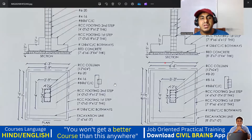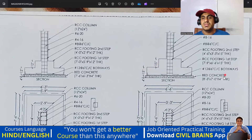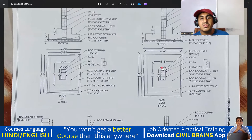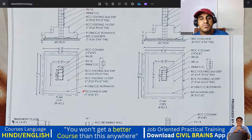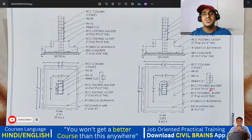Looking at the depth of the footing — previously in C1F1 it was 12 inches and 12 inches for the two steps. But here you see it is 15 inches and 15 inches. Also see the size of the footing: C1F1 first step was 7 feet by 5 feet 9 inches, but C2F2 is 7 feet 9 inches by 6 feet 6 inches — obviously bigger. The second step was 4 feet by 2 feet 9 inches for C1F1; this is 4 feet 6 inches by 3 feet 3 inches. Obviously this footing carries more load. In the footing reinforcement, you're still providing 12mm diameter at 6 inches both ways — minimum reinforcement in the column taking care of the load.